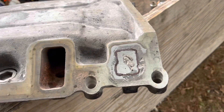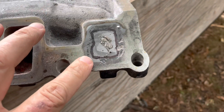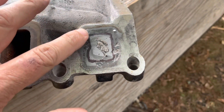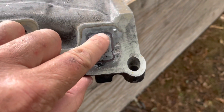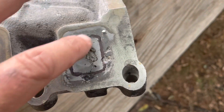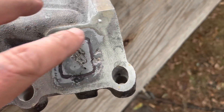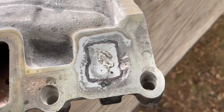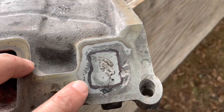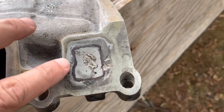I have now sanded down the epoxy area smooth and flush with the surface. I then went back and marked on the surface — everything inside the black line is going to be taken out with a carbide tip grinder. I've got this air-powered carbide-bladed grind tool, and I'm going to gouge out all of this all the way out to the edge of the black line. That should clean this up and get it back to a repaired state where it'll seal on the gasket. You can see where the epoxy has filled in this area — this is all corrosion all the way around through here and the epoxy has filled it in.